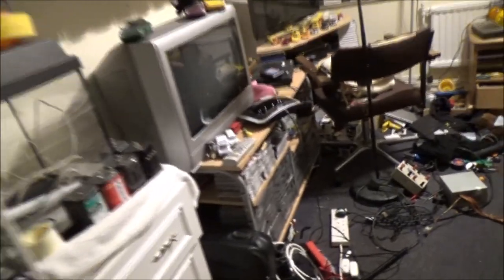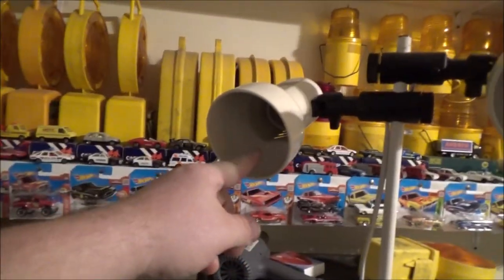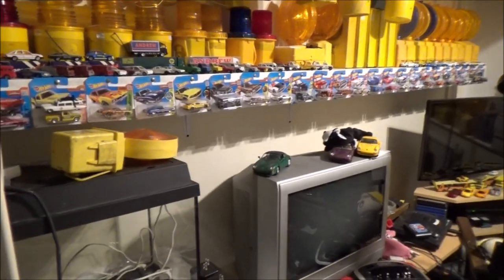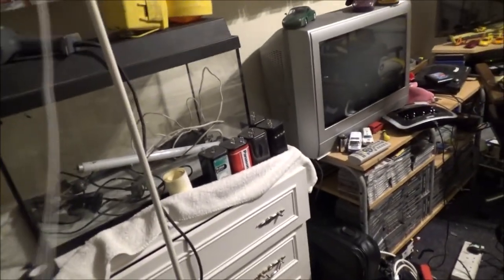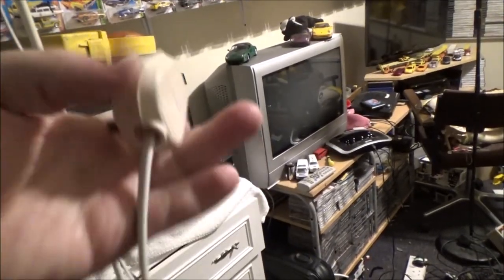They still flickered. And then I noticed when I tapped on the switches, they would stop flickering, or at least this one would stop flickering. That one would, and then start again. So I then suspected the switch contacts. To confirm the switch, I took it all apart. As you can see, I took all the switches off. There was just one plug. I'll show you the bit in a minute. So I just stuck a plug straight to the lamp holder, plugged it in. No flicker, so that confirmed the switches.